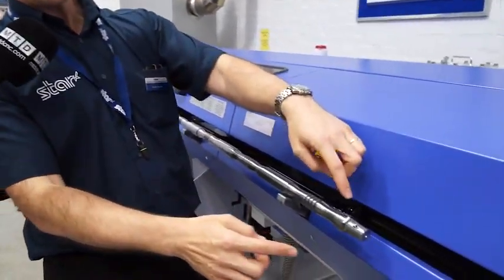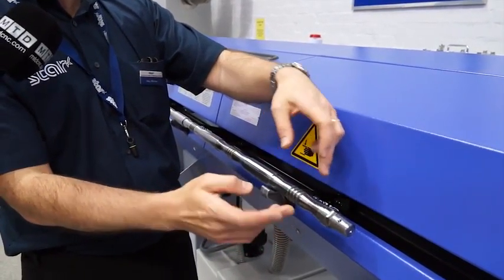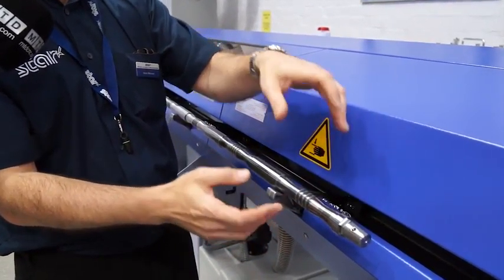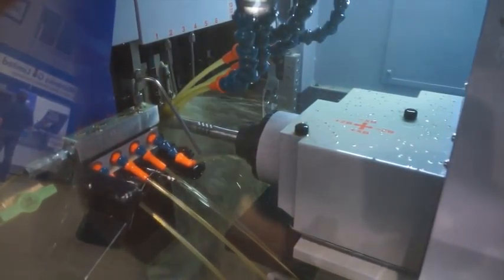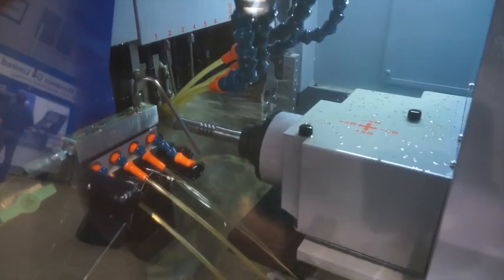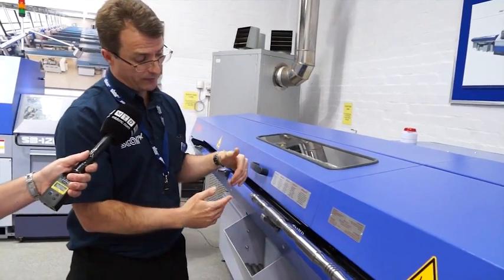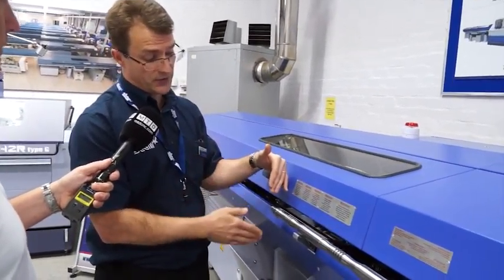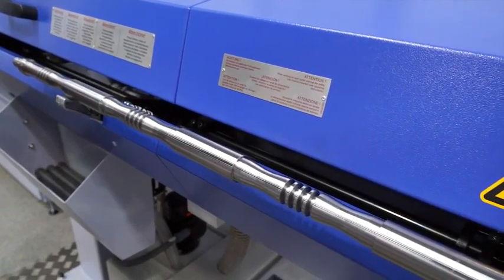So we'll basically start at the beginning, do the center drilling, the turning, the cross drilling. We'll then turn this section down so far. At that time, the sub-spindle will come over and support on this diameter, and then we'll turn the next section of the shaft, and vice versa, all the way down, until we've got the component this end, we part it off, we take it away, and we process the rest of the component in the sub-spindle.